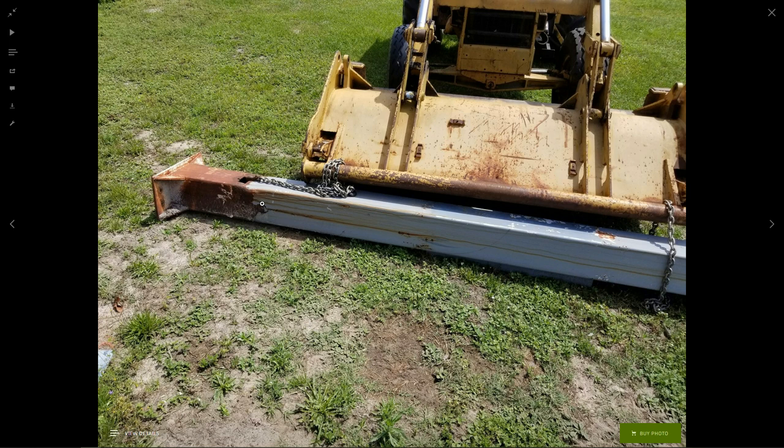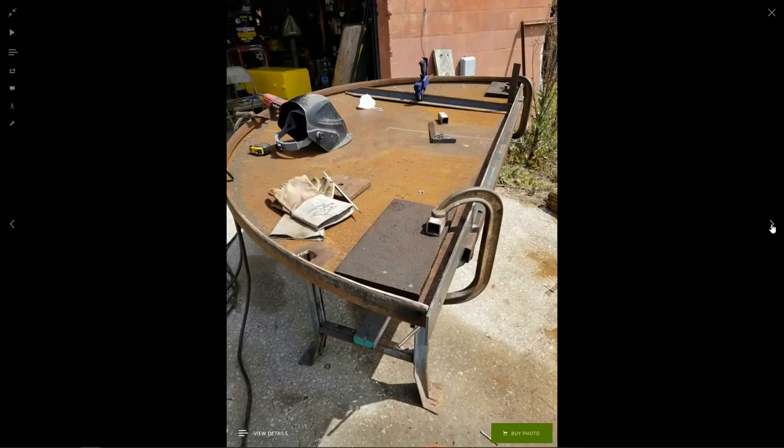I've got a piece of angle in here basically to ensure that the flat bar stays square and doesn't turn in or out as it's being welded in, and also to try to see how much of a belly I have on the table — this piece I didn't really have that much. This piece of square tubing was actually at my office. Because it's an old gas station, there was an old fuel island canopy that we cut down like 6-8 months before. This was the top where your roof with lights was hooked, and the bottom end was in concrete. When we had the people tear it down, I said I want to keep the square tubing for a later project, and it wound up working out pretty well for this table.